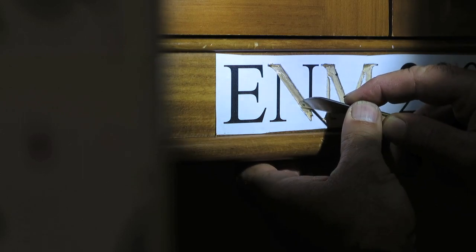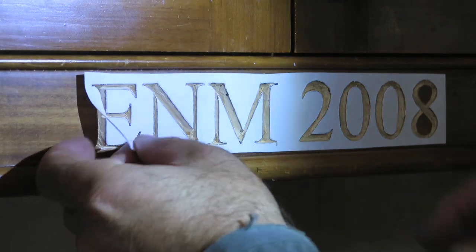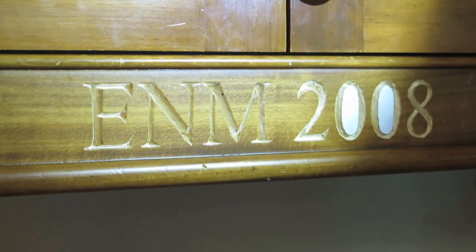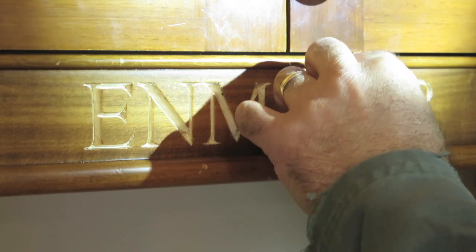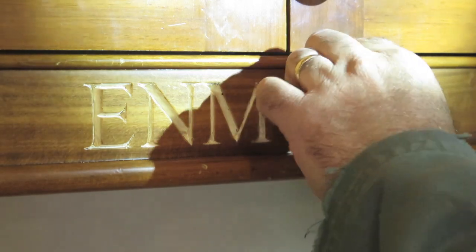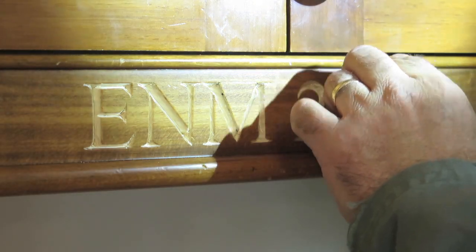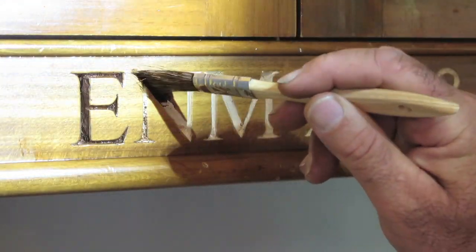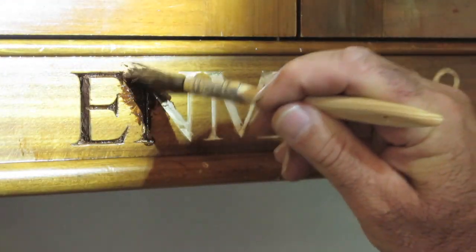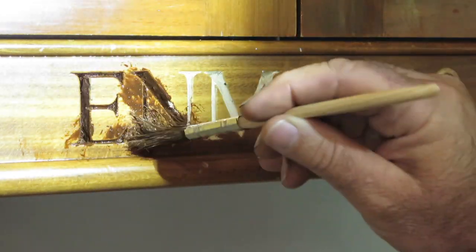When all the letters are carved, just peel off the paper. Because it was fastened on with rubber cement, it peels quite easily and fairly cleanly. You'll find that the carving of rounded letters and numbers is more challenging. When the paper pattern's all gone, I will clean up the cuts and remove any ragged areas I can slice out with the sharp knife. And in this case, because I'm working on a cabinet that's already finished, I'm going to daub in some stain so that the incised letters match the surrounding area.